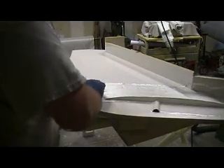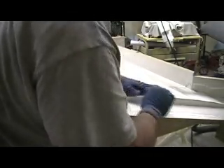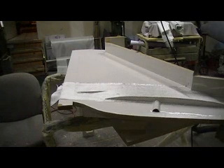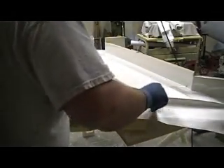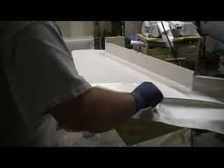I'm trying to get that first layer really worked into the corners good. Now I've got not quite a quarter inch of the white resin and I got this first layer of cloth really worked into them corners good. So now if these other layers do happen to bubble up just a little bit, it ain't no big deal. Don't sweat the small stuff — can't sweat the small stuff. Learned that a long time ago. One thing my daddy taught me: when you set the hook, you set it hard. And don't sweat the small stuff.